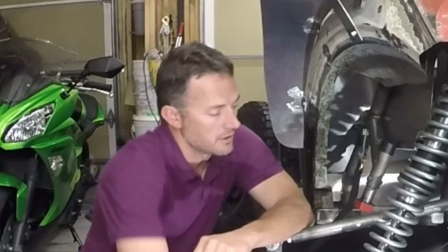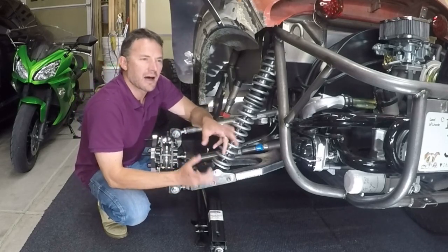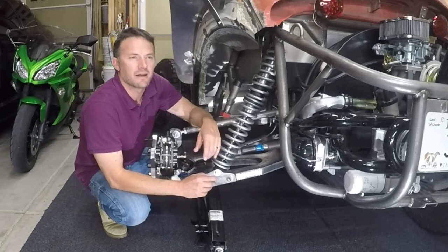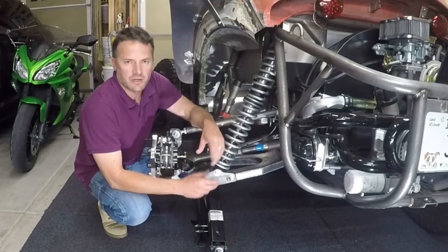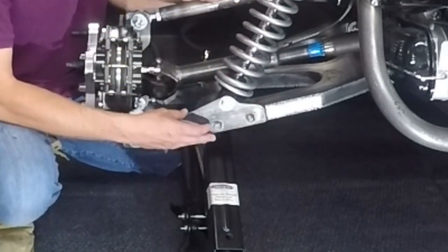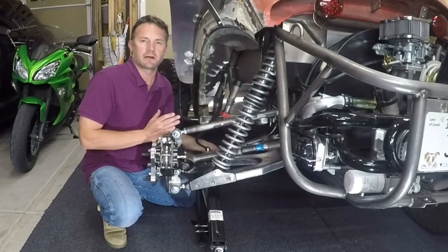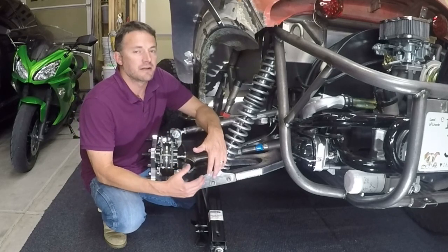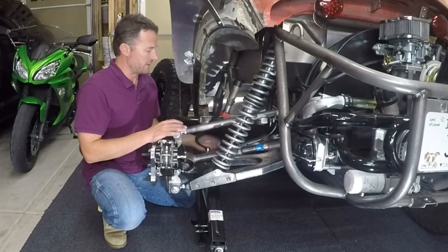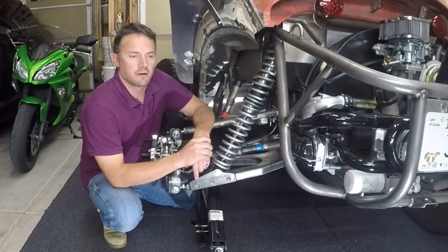In a nutshell, that is it. There are a couple of things that I would have done differently though. Number one — this lower control arm is an inch and a quarter thick. I feel like that's maybe a little bit on the thin side, and I kind of wish that maybe I would have gone like an inch and a half. I've got all of this support here for the shock absorber and I really like that, but then for some reason on the other side of the control arm where the bump stop hits, I didn't add any extra support. Again, if I had it to do again, I would add some bulk over here so that if the bump stop actually hits that control arm pretty hard, there's more metal there to support it.